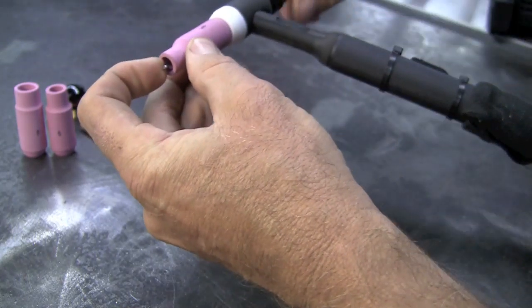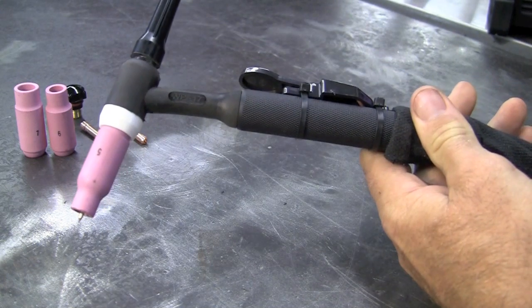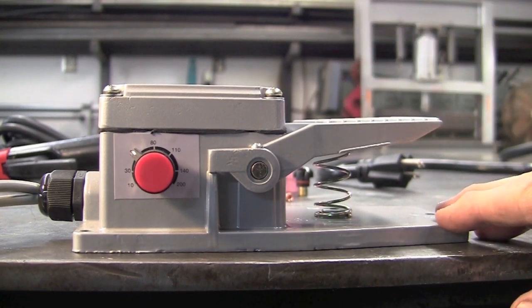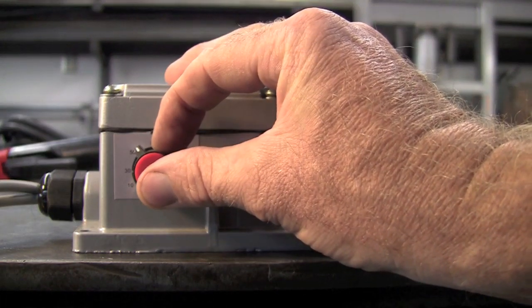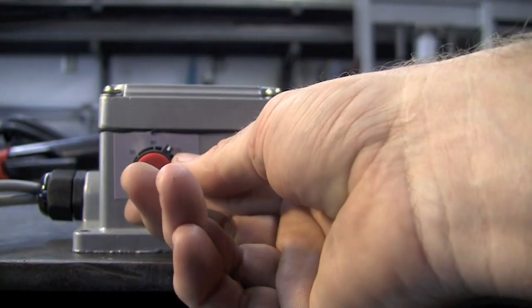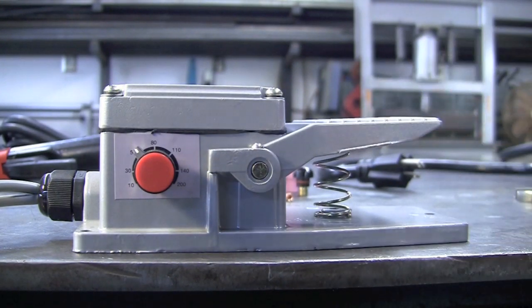I'll get a little stick-out — I usually run somewhere around a quarter inch or so — and that's basically the torch setup for this unit. Here's a shot of the foot pedal. When we hook the foot pedal into the unit, it becomes our amperage control, and for the first time we actually have a little scale on it that tells you how many amps you're dialing in. The foot pedal is really nice, very progressive, very positive feel, metal construction — should last a long time.